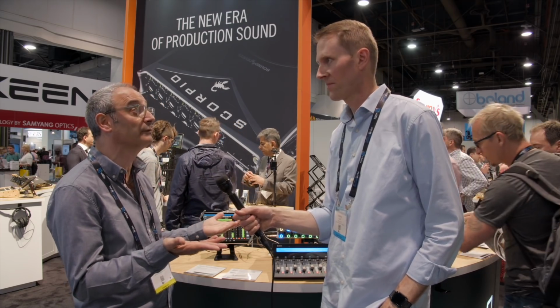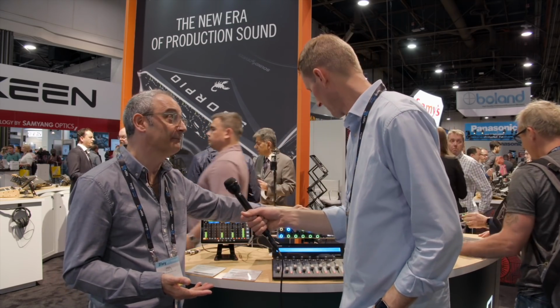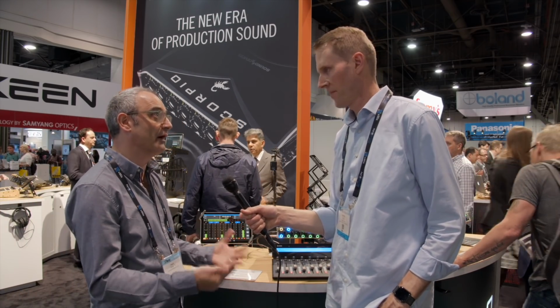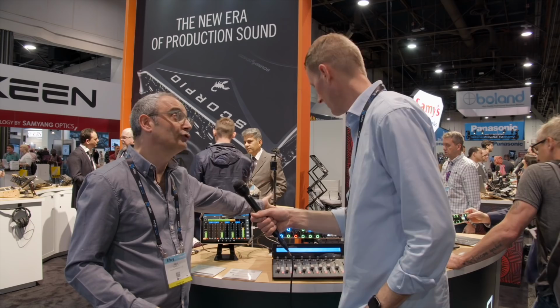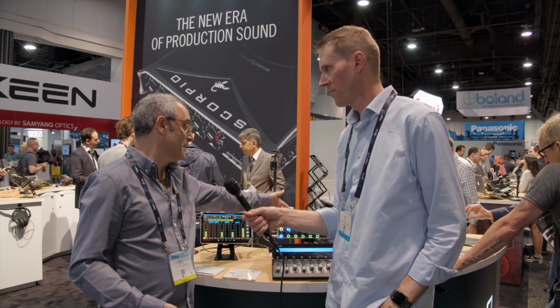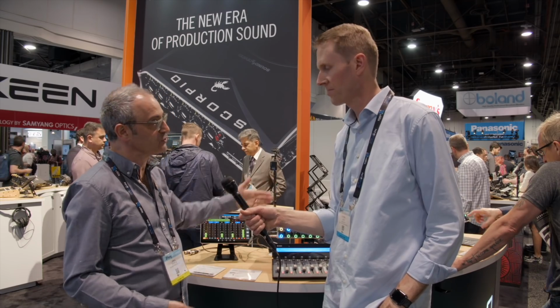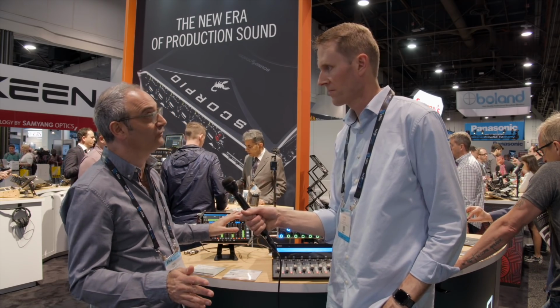So a couple of examples for you. Turn off a mic preamp, everything about it is shut down. The ADC, the actual input, amplifier, and everything. If you haven't got Dante plugged in, the hatch will close because there's a sliding hatch which the connectors fit into. The hatch will close and it will shut down the entire Dante circuitry. So things like that. Very good.